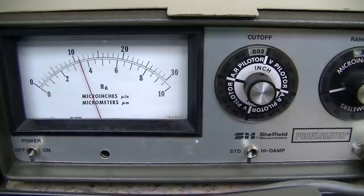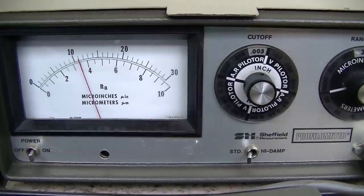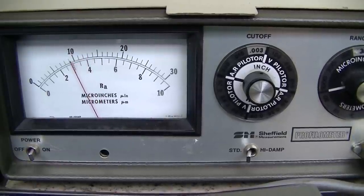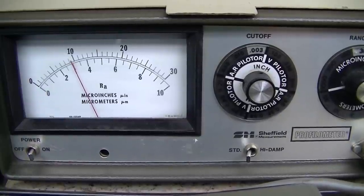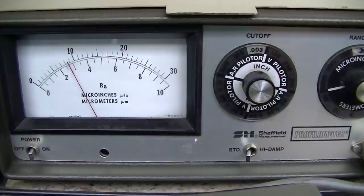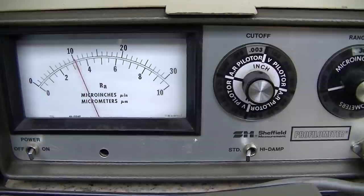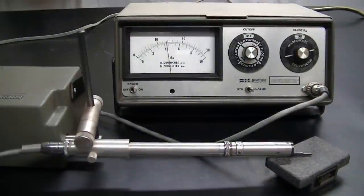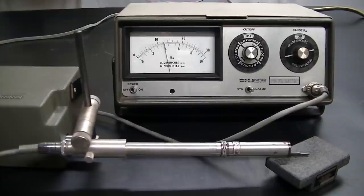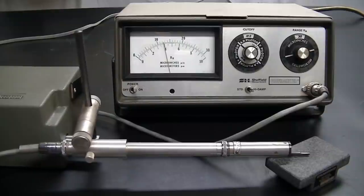So that's what I'm going to target on the other plate, to get in that general range, because obviously to do a AAA plate, Starrett, Herman, whatever you want to call it, the plate company decided that they needed to go finer grit to get to that level. So that violates the federal spec of less than 16, going below 16 RA. Okay, I'm shooting for a 10 micro inch RA finish on the granite.